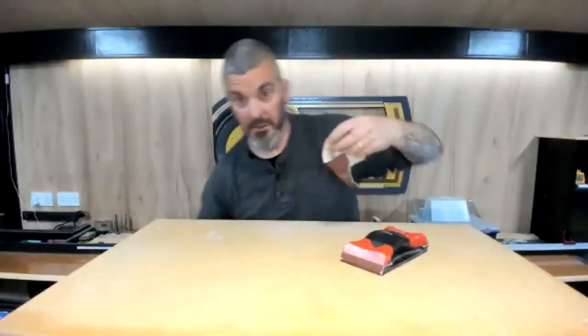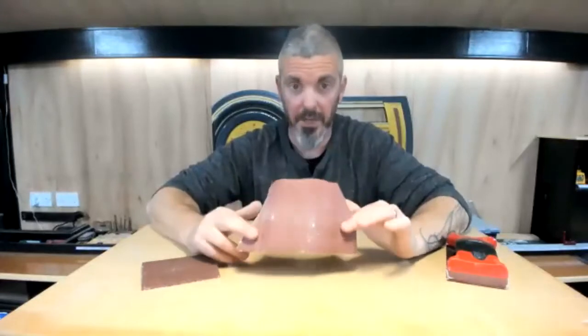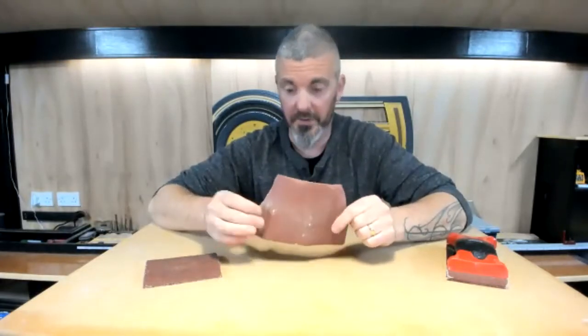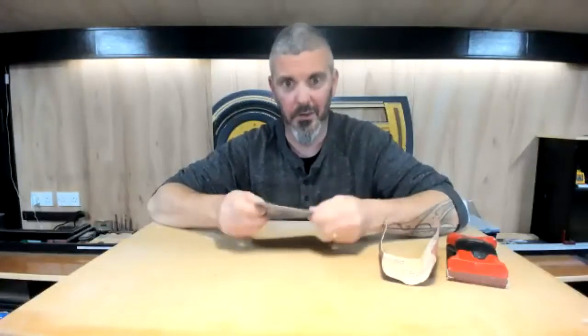Okay, now I do have an opinion here on sandpaper. I was going to ask, yeah. There are a few different types, okay? The ones I avoid, for walls especially, is paper sandpaper. There's the paper back here. That's just paper with little grits of sand glued onto it. Yeah. I now stumbled upon this stuff where basically it's fabric backed. So this now won't tear. It won't rip like a sheet of paper. It's good and strong. It's like a piece of fabric with sand on it.